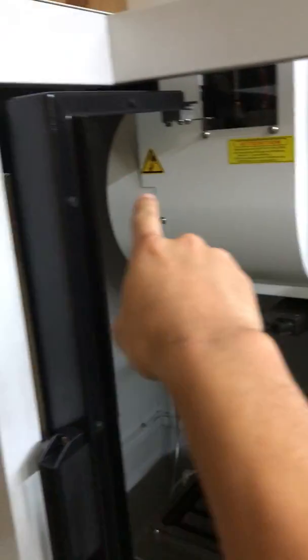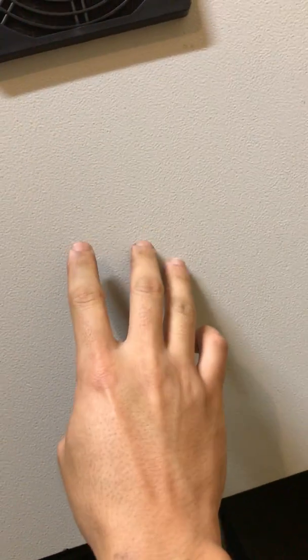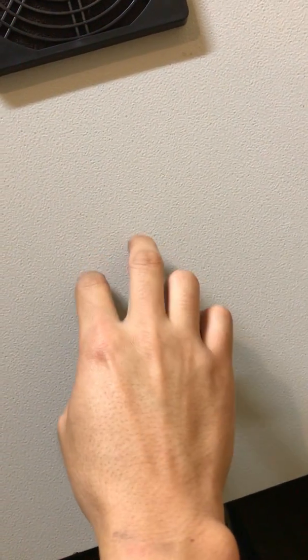There's the filter regulator lubricator. There's the automatic oiler, and then here's a power on switch. Mine is a 220 single phase version, and there's actually a terminal bar inside with three wires. I think there's ground and neutral and live or something like that. Anyways, you can run your own plug or hardline it through this. I guess it's an intake.